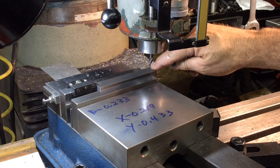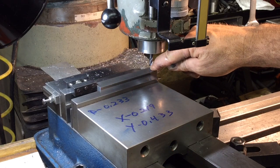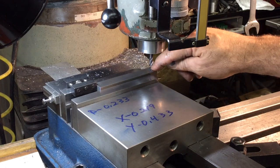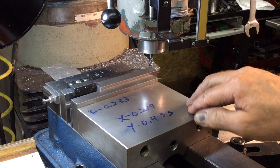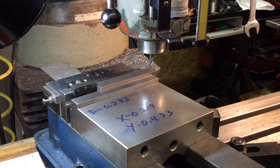This other side where it goes into the corner - I'll either touch it up with a file if there's a little bit left, or I'll touch it with the end mill when we do the other side. It's a real small little lip that might be there - you want to get rid of it, but it's not too difficult with a file. Like I said, I'm doing five of these things total, I'm just showing you one.